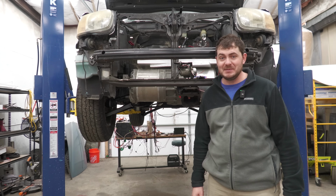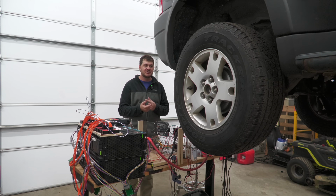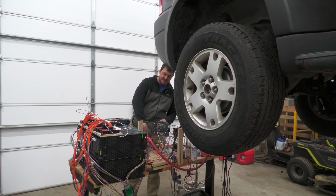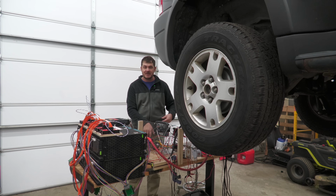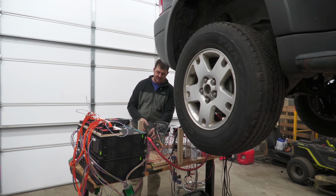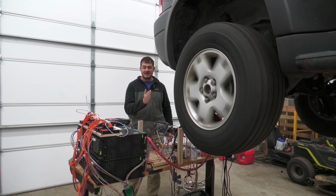However, there is a problem already with the VCU. There's something very wrong with the throttle response with the motor direction reversed, which is important for the front motor because it's mounted backwards, so the motor direction has to be reversed. But I'll demonstrate on this rear motor here. If I put it in drive, and I've configured this one backwards, so the wheels will spin backwards, and give it a big stab of the throttle, it doesn't do much. But if I put it in reverse, and do the same stab, it spins up quickly.